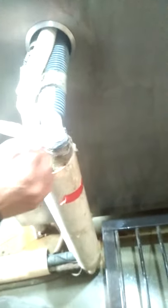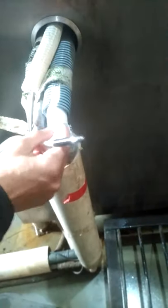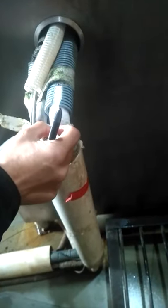Now to produce this refrigeration effect or cooling effect for this water, here we are using two separate refrigeration systems in this particular plant. Here we can see the parts of this refrigeration plant. At this particular end we can see two different pipes — one copper pipe of lesser diameter, and another copper pipe covered with frost of larger diameter, with some insulation provided. The smaller diameter pipe does not have insulation.